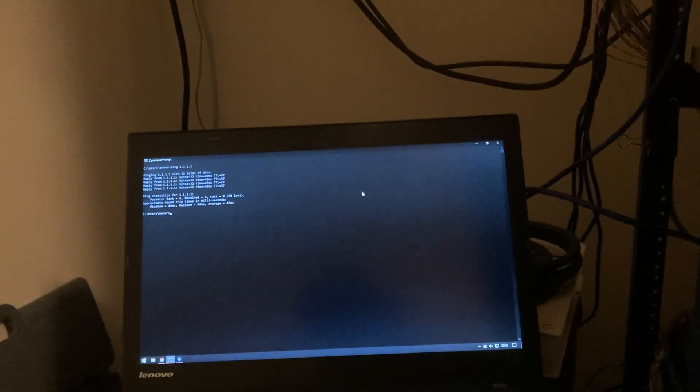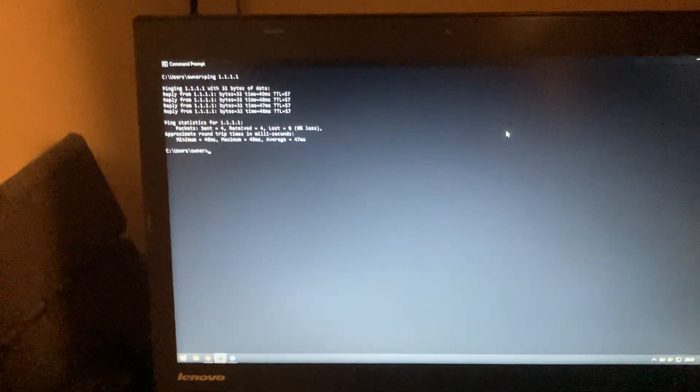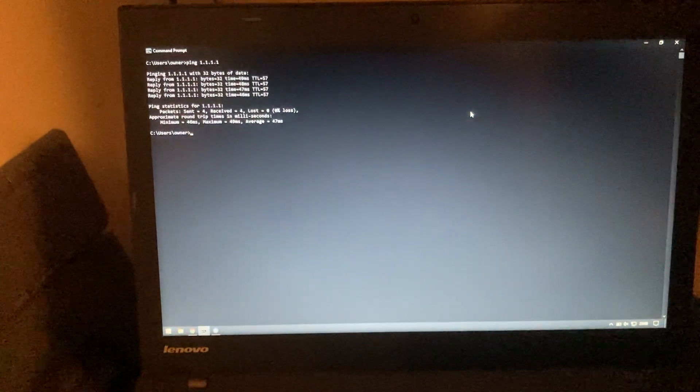Over on my laptop, it's just plugged into the modem over Ethernet. If we ping 1.1.1.1, it goes through. Now, that looks like a really slow connection, and that's because it is. This DSLAM is very old and it's going over ATM into an old router. Pinging my home router from this computer — just straight through all this and through my switch — is about 35 milliseconds. So it's not great, but I can't really bash it. It's old equipment, and that's kind of what I wanted anyway — an old DSLAM, because I like old networking stuff.